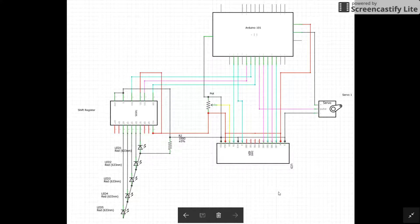Right now we have the schematic view of our circuit. We have the Arduino 101 board up here. We have a red wire displaying the 3.3 volts going to the LCD screen and the shift register. We have a ground and this black wire connecting to all of them. We have the same color wires for the PWMs and the normal digital pins from the Arduino board.